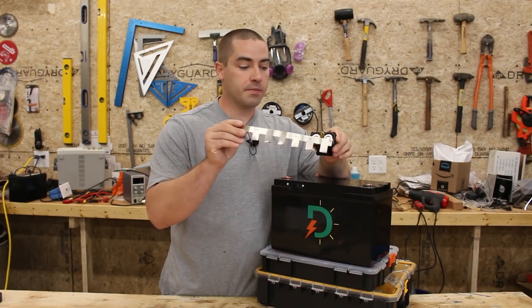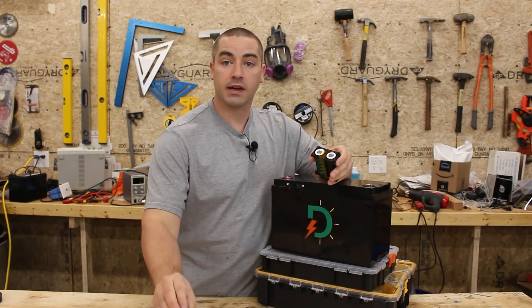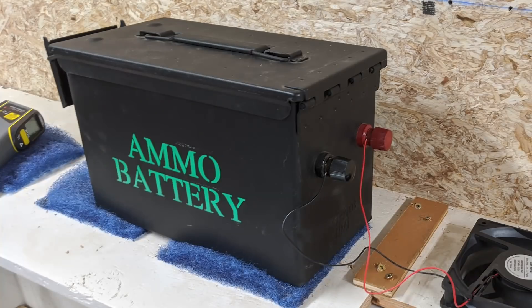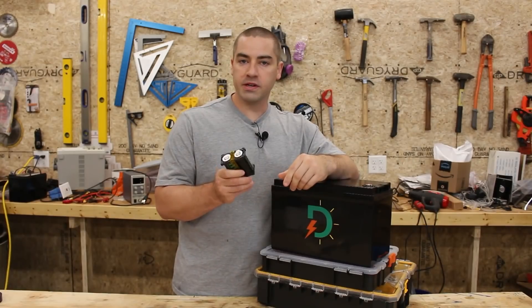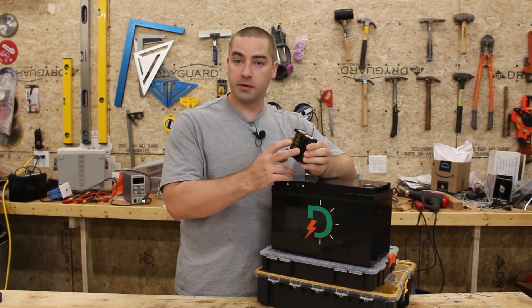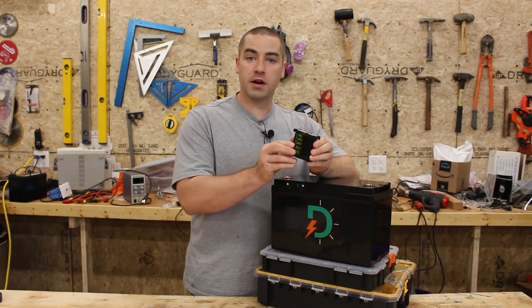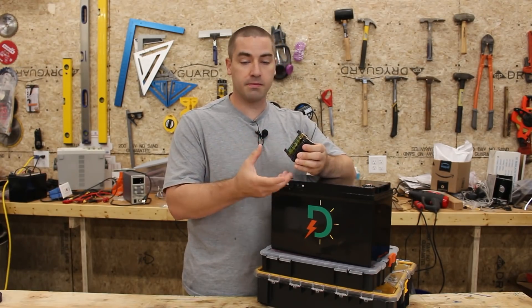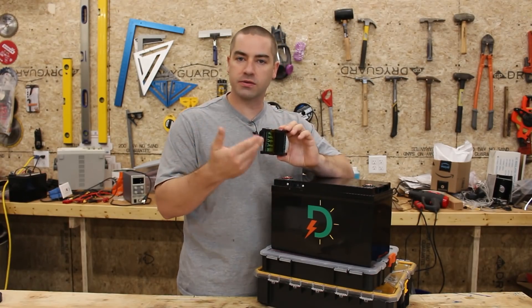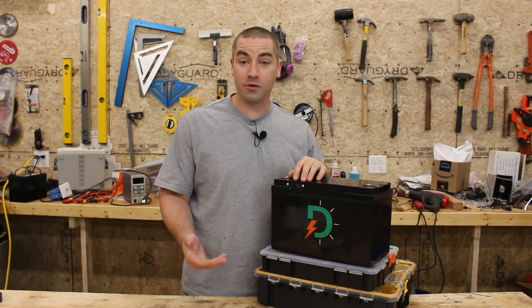I use a piece of nickel strip directly onto the cells, and this nickel strip is not cell-level fusing. In the past I've built projects such as my ammo box battery which does have cell-level fusing. In this project I didn't do that because these are lithium iron phosphate — a safer chemistry — and these are factory new cells, all from the same lot and same manufacturing date. I just don't see the need for cell-level fusing, but there'd be nothing wrong with adding it if you choose to.